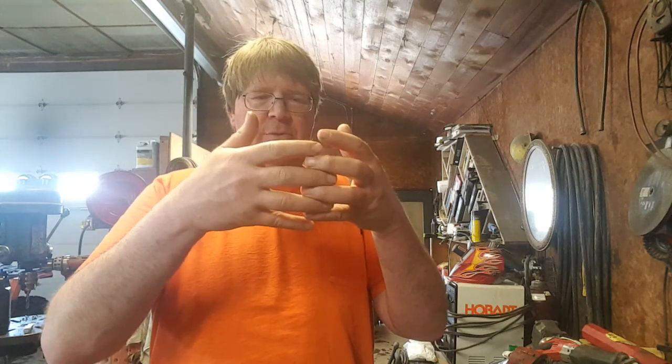So you drill that hole, and then you're going to cut the threads through with your tap. If that hole's oversized, your bolt is the same diameter, so you don't have much thread engagement there. If your hole is the proper size, then you'd have better engagement.